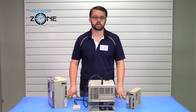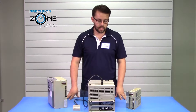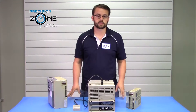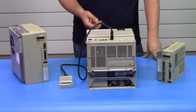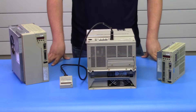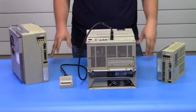When talking about your braking circuitry, you could be getting alarms A30, A32, or A40. Those typically indicate a failure in the regen circuit of the drive, and that can also be caused by your regen resistor being disconnected or burned out.